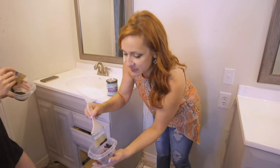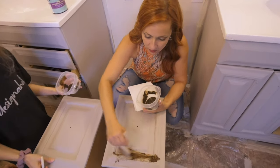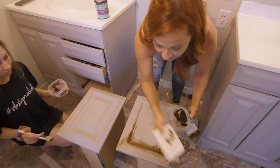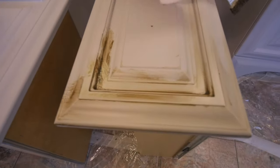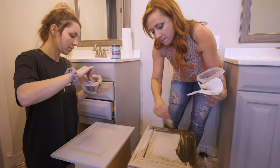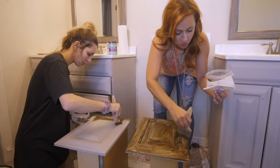We poured the antiquing wax into a container — it just makes it easier to use. Kayla and I are going to start on these two drawers right here. I'm going to start first to make sure I like what I'm doing, because to be honest I'm not sure yet. I'm going to cover a little section and then wipe off with a paper towel. Do you see the difference? This is a very cool gray, and this is a very warm gray — much taupier. I'm guessing it's going to bring us much closer to the color in the mirror. I'm pretty comfortable with this now, so I'm going to get a bigger section covered. Kayla and I are going to work side by side to make sure we're matching. Remember, work quickly because you don't want this to start drying — just go back over what you already did so that when you start wiping off, it's going to be consistent.